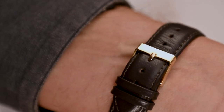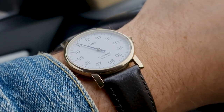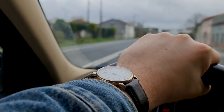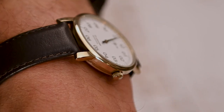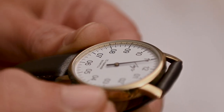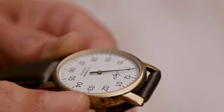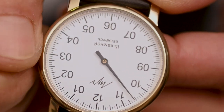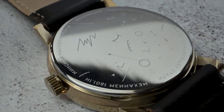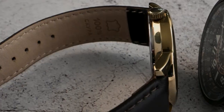The caliber it mounts has only 15 rubies — it doesn't need more, because it lacks a second hand. And though they advertise a 38-hour power reserve, it's actually 31 — at least mine doesn't have any more than that. It beats at 21,600 vibrations per hour, and its precision is from minus 30 to plus 45 seconds per day. I can attest to this — mine gains about 30 seconds a day. It's a manual wind, as I've already said, and that gives it a special charm. It also sounds like the old clocks that you'd hear your grandfather from meters away when he was winding it, because this one too sounds loud and very pleasant. The glass is completely flat mineral, which also contributes to the fineness of the piece.